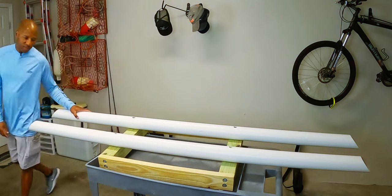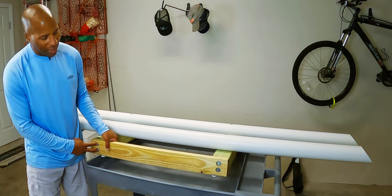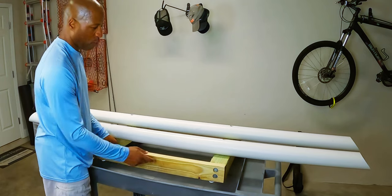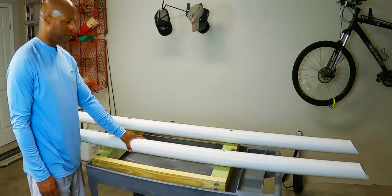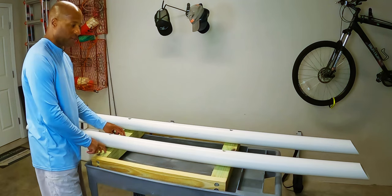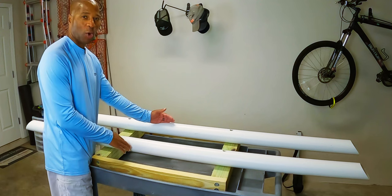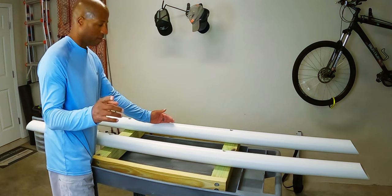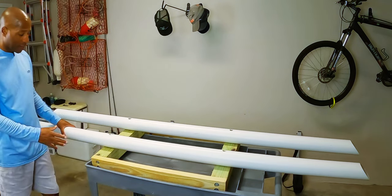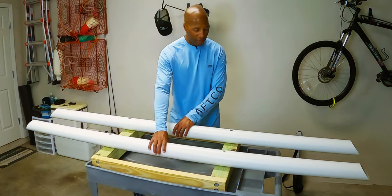The box is quite easy to build. It's made of two 4x4s and two 2x4s connected by two lag bolts in each of the 2x4s into the 4x4s, and that's on both sides — so you have eight lag bolts holding the 2x4 against the 4x4. In addition, you have the PVC tubes. These are eight feet long and they have a wider hole up at the top. In the middle, there is a lag bolt that bolts it to the 4x4s. These two on center are 11 and a half inches apart, but that's for my kayak — I have a 2022 Hobie Outback. For your kayak it might be different, so measure the two grooves that go down the two sides of your kayak, space these that far apart, and you're going to be good. Really, that is it in terms of how difficult it is to build this cart — it's a box with two PVC tubes nailed to it.